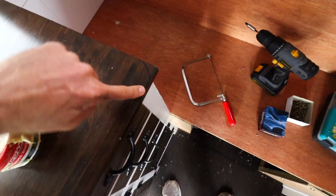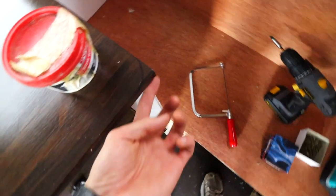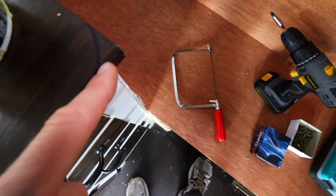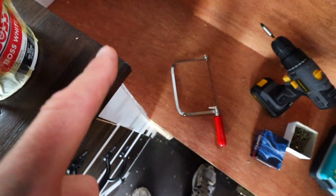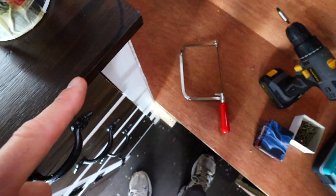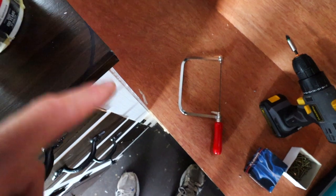The next job for the SQI engineer check - he had two things he wanted changed in the van. One was the two-burner hob, and the next was to round the corner edge on the end of the worktop. This is the countertop and he wants me to round that. What I've done is marked it out, and I'll use the coping saw to go along the edge. Once that's cut, I'll get my handheld router and put a chamfer on it to chamfer the edge.